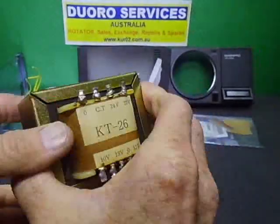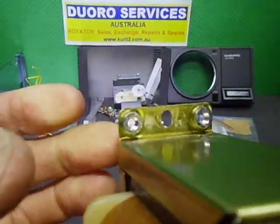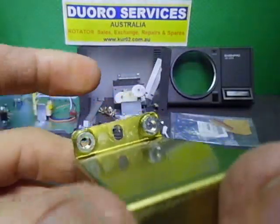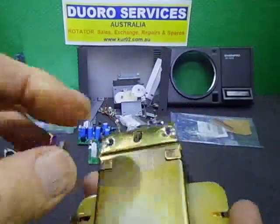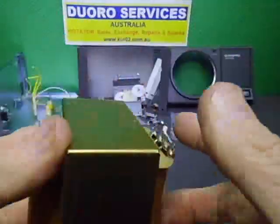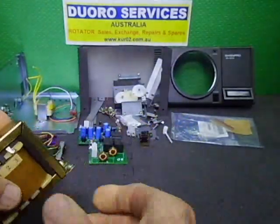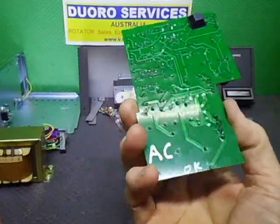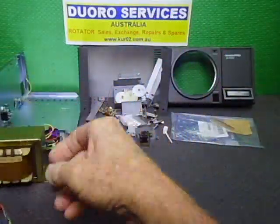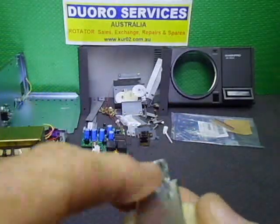As you can see, I've put clinch nuts — or cinch nuts — in here. The original only had one bolt in the middle and the bracket would flex and bend badly. So I've put two in each side. For this one I needed a separate little transformer for three voltages since I couldn't use the center-tap side — it's also got M4 clinch nuts installed.